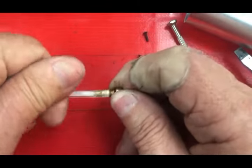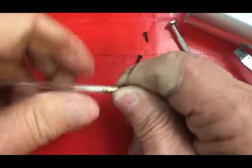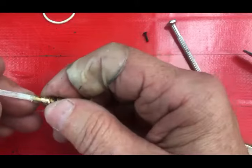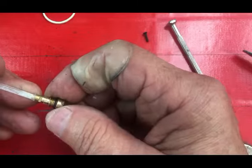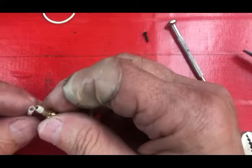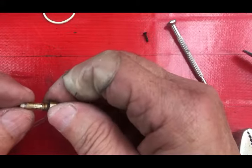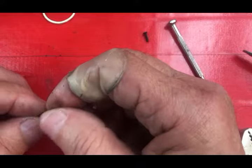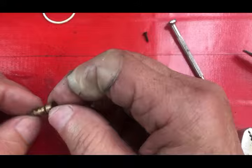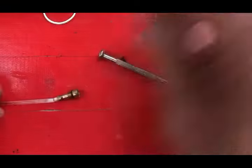I really don't recommend that you do this repair. If you get one of these leaking badly enough and you strike it, I can see you blowing yourself up pretty easily. It looks as though this is one piece — you can see the damage done in here. It just broke off when I did that. Apparently they melt it together. So I thought this valve was serviceable, but apparently it's not. If it leaks, you need a whole new piece and replace it as one piece.